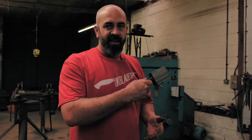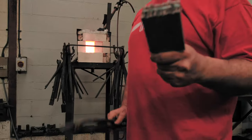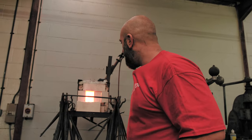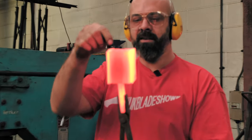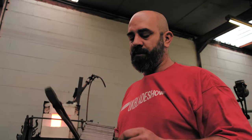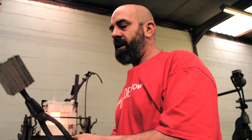There's only one way to get it hot and that's to stick it in a fire. Because these aren't perfectly flat — they've been ground, not machine flat — I'm just going to chuck it in there until it's about cherry red. It's going to be a gradient of heat: hotter on the top and bottom, less hot in the middle. I'll give it a couple of gentle taps of Bertha to make sure all the faces marry up, soak it for a minute, then weld it. You just want to soak stuff, get the grain boundaries breaking down and get everything to stick together.